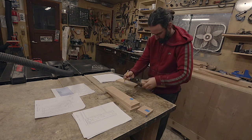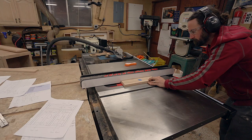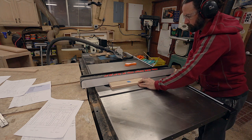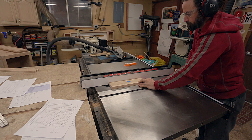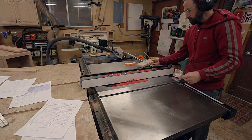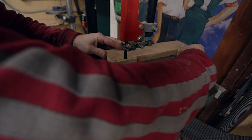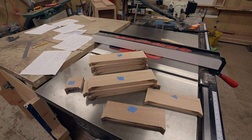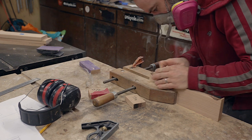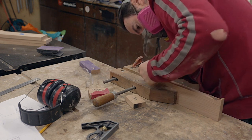Here's a quick description of what I do for the accent cut. I mark out what I need to do on the piece of wood, drop my rip blade into the table saw and sink the height below the table, turn on the saw, raise the blade until it just breaks the surface, and push the piece to the ending location. I then stop the saw, wait until it completely stops spinning, and remove the piece. I go over to the band saw and finish cutting out the little triangle corners, leaving pieces with a rough bottom. I take these over, clamp them, and sand flush with 150 then 220.